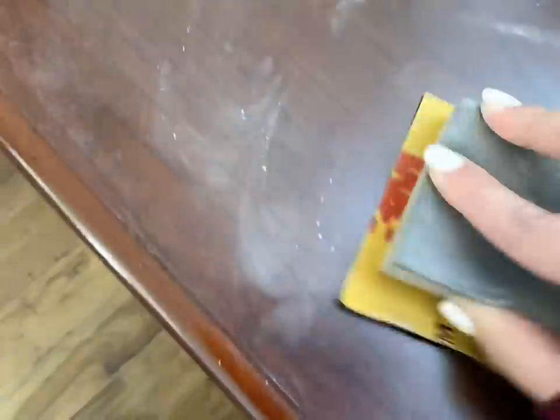400 grit sandpaper is my absolute favorite right now for sanding in between paint coats if I notice some debris in my finish, or if I've got a rough patch where the paint dried too quickly while I was rolling. But other than that, I don't really sand the entire piece. I just sand spots that need it, or if a spot is super shiny. I feel confident doing that because I've done the scratch test with this paint on these particular types of wood.